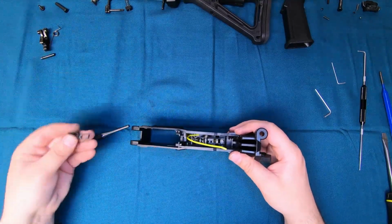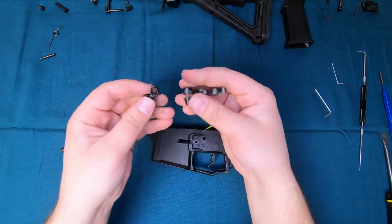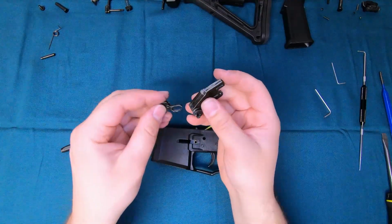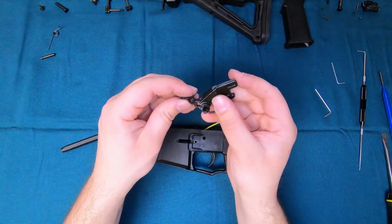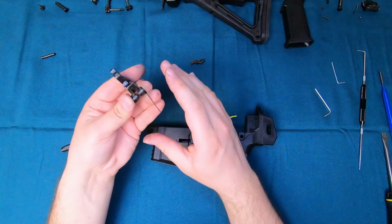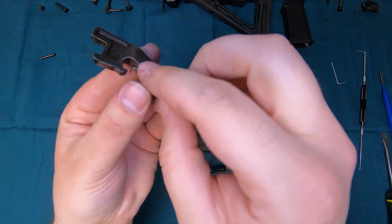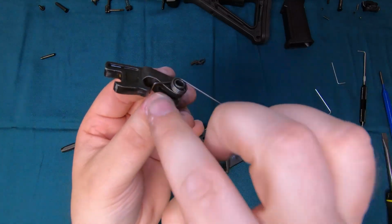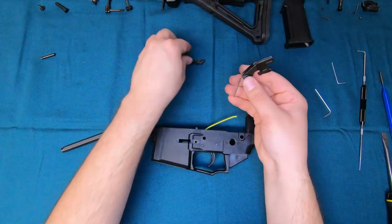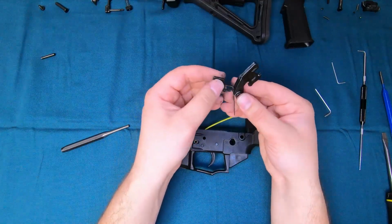And now we can move on to the hammer. So the hammer composite piece again, this is the front side, or I should say really the top. The knocker is going to go inside where it can slide back and forth so the holes line up. Alright, and the hammer spring, you're going to put it on the right side with the L behind the hammer. Alright, knocker on the inside with the L upwards. Okay.